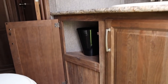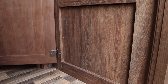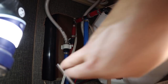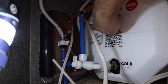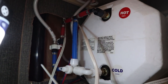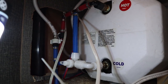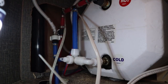My water heater bypass valve is down behind this access panel in the half bathroom, so I'm going to get that panel removed and then take a look inside at where the valves are. Here's my water heater — this is where the cold water line comes into the system. Then from here, this is the bypass valve, the bypass line, and this is where the hot water exits the system. When I flip this valve right here, you can maybe hear the water flowing — that cuts off the bypass line and allows the water to flow into the tank and then out the top. You may have a valve here, here, and here. If that's the case, you'll want to open the top and bottom valves and close the valve in the bypass line.